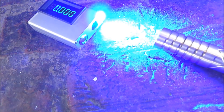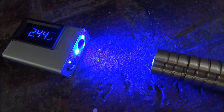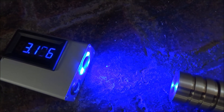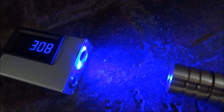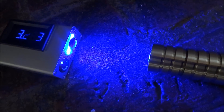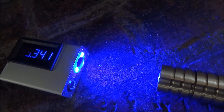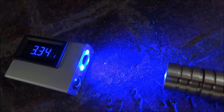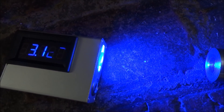I'm going to measure this one with an LPM I recently reviewed — I'll put a link down below if you're interested. I did a couple of different readings at different times, all with the battery fully charged, and I got readings of about 3.2 to 3.3 watts. That's very high, but it's definitely lower than the 4 watt advertised power output. I believe the explanation for that is in the lenses.